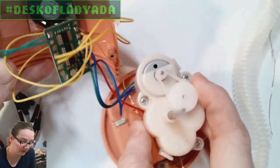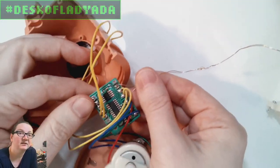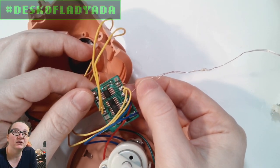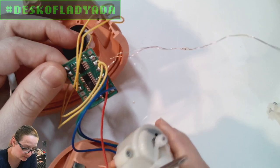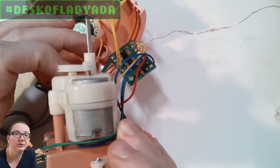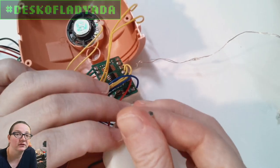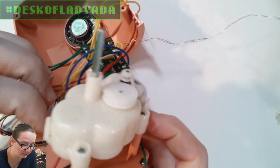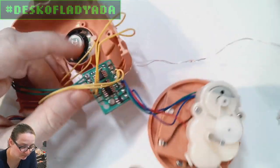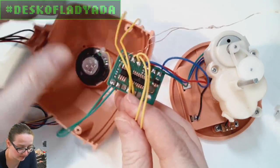Underneath is the battery pack - it runs on three double-A batteries. Here's the electronics - there's a lot of wires. The LEDs are connected to just a GPIO and flashed. There's a DC motor, a 4.5 volt or 3 volt motor, with a belt to a gear train that slows it way down because it's like a 3000 RPM motor. Here's an on/off switch, and then we've got the speaker driver.